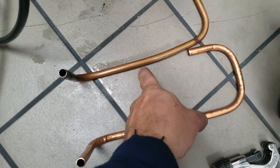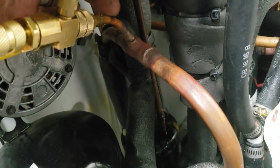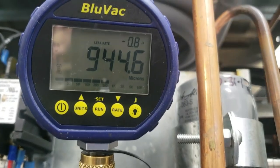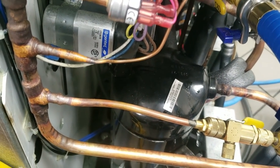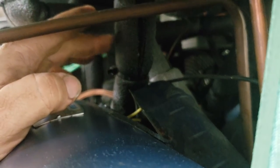Here's mine, here's the factory's — done brazing it, purging nitrogen through as best you can. This is one of those calls that just keeps going. I went ahead and put a new quarter-inch stem in there — the other one was leaking, which is why my vacuum would not hold. Now we've got it replaced, it's falling down, but there's quite a bit of moisture on this thing. I think the filter dryer's going to have to do most of the work. Also, the customer's not using the right belts, and because of that the motor's so high that the capacitor's hitting the fill tube with the barrel, and they can't be put back into place. If you take the belt off it can be, so you need to use the right belts.